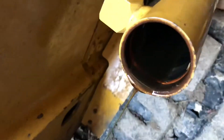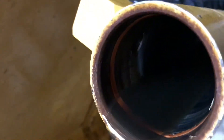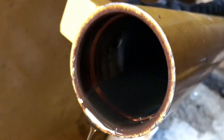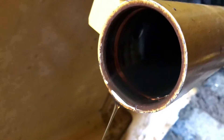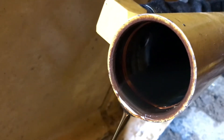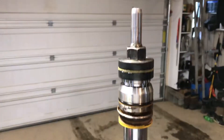Here's that internal snap ring that has to slide past the groove using that plastic ring shim. Another thing to mention: that orange ring you use to remove the cylinder piston is only needed for removal. You don't need it to put it back in, because that groove is tapered inward, so the snap ring will slide right in when you reinstall.